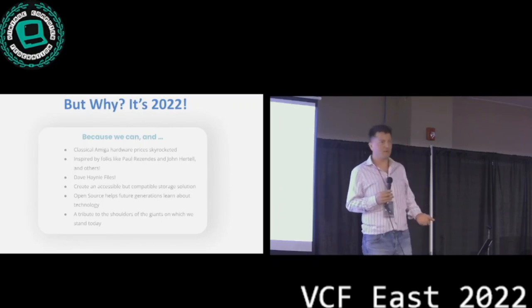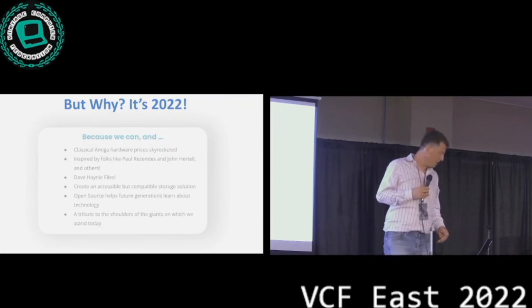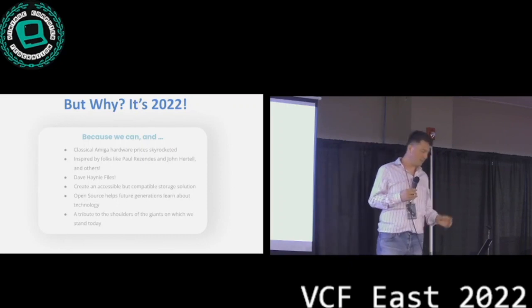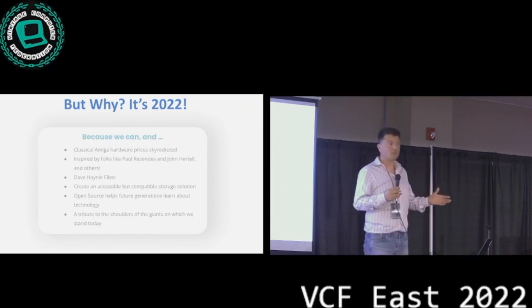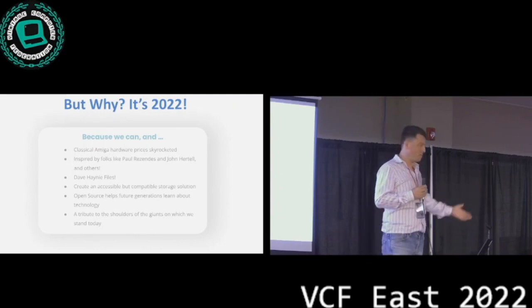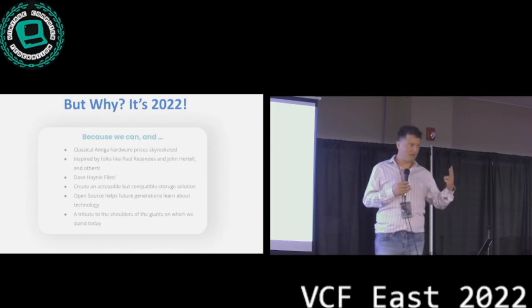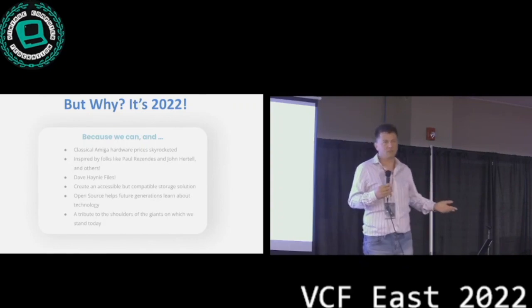And then of course there's one important thing to this whole story. It's the Dave Haney files, all right? Dave has published all of the logic files for the GALs, the little SPLDs that are powering this board, as source code. And so you can download them today, recompile them, put them on a board, and it'll work. The other card that I mentioned out of the two that exist, that logic is all secret, and most likely if these cards die, it's lost forever.